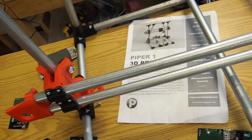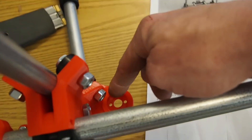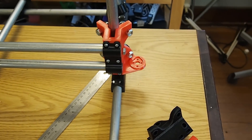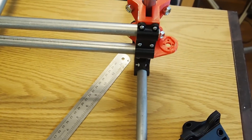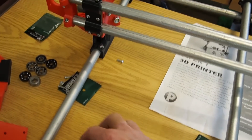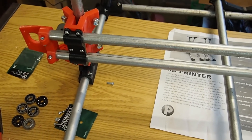After further review, I've discovered my first mistake. This one has got to go over there and this one's got to go over there — the bracket for this mounting as well as the lead screw hole needs to be over there. So I've got to switch everything. Okay, so I've got them switched around and now they're on the right side. The stepper will sit under here — there's a little motor mount that goes up under there, same on the other side. I've got one for the back and one gets mounted right up there. So I'm going to go ahead and do those now.